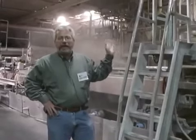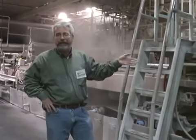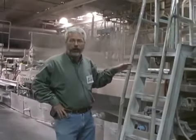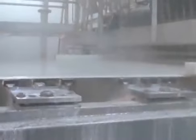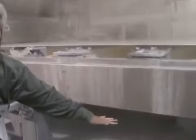I'm standing here by paper machine number four. You've just seen the pulp being processed and it's being fed into the wet end of the machine here, where it will be laid out onto the wire of the machine, getting ready to turn this pulp into paper. The paper pulp consists of about 98% water, and the idea of the wire is to remove the water rapidly from the paper fibers. You can see the water dripping out of the paper fiber now.